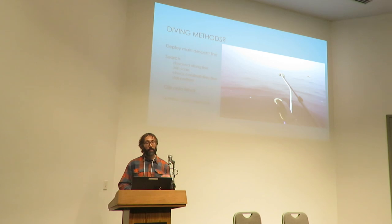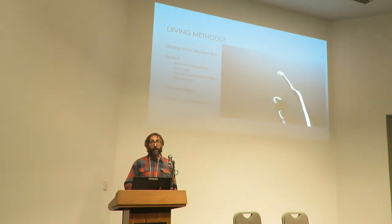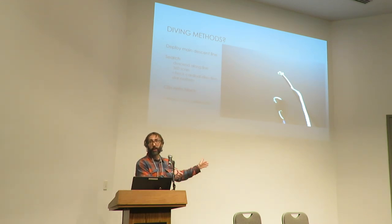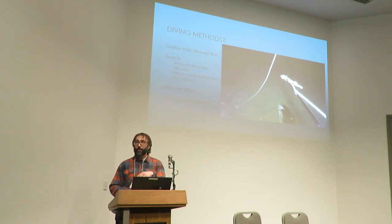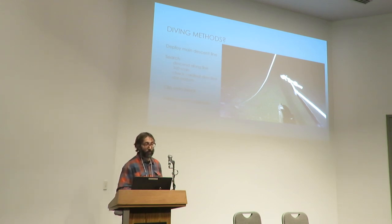I want to walk through our diving methods. That GPS coordinate is very important to this process — we know generally where the receiver should be. When we send the ROV after it, we hover on top of those exact coordinates, throw the descent line down — which is just a 15-pound anchor — attached to buoys up top. We send the ROV down that anchor line. We get to the bottom, do a quick 360 scan in case it's nearby. We have a general idea of whether we're east, north, south, or west of it. We look at the compass, go the right direction, do a star pattern back and forth until we find it. We click on, surface, celebrate — high fives.